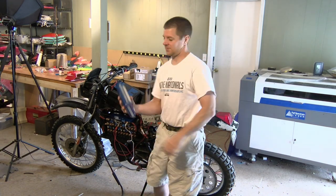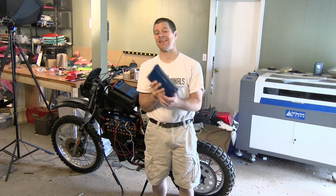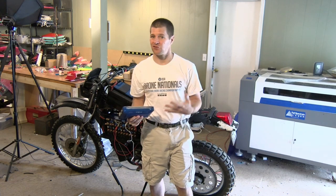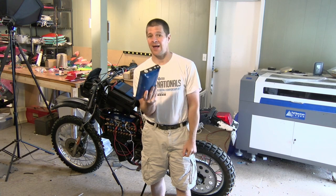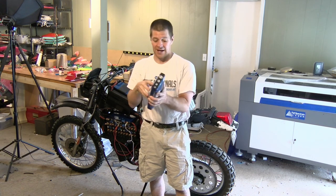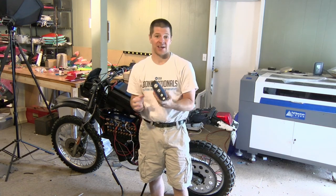What happened to me was this — an incredibly swelled up battery pack. Now, I like lithium phosphate batteries. I'm not a big fan of lithium ion or lithium polymer for electric motorcycle applications due to their flammability. If this were a lithium ion or lithium polymer battery, I would not be holding it. Because this is a prismatic cell, the casing is solid aluminum. That's a lot of pressure to do that — I can't even squeeze that battery. It might as well be solid; there's so much gas pressure in it.